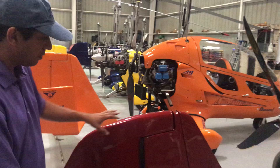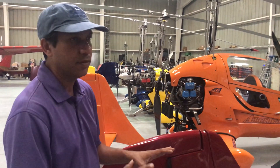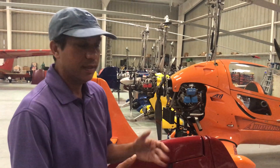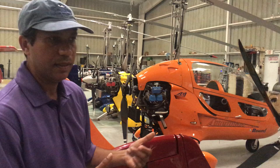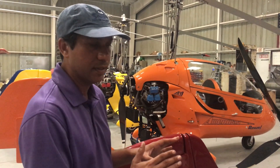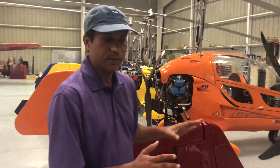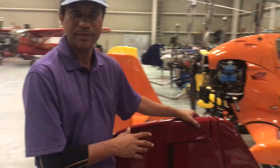So that's the changes we have done on the tail to make the AR-1C with the canopy easier to fly. With the canopy you do have to use some rudder — the AR-1 without canopy is very stable and you really don't use much rudder. But with the AR-1C canopy, as you change power there is a little power coupling, and with speed you have to use a little bit of left rudder. To make that very easy for customers, we have reduced the rudder pressures by using this balancing horn.